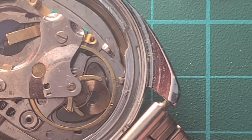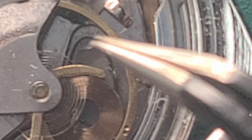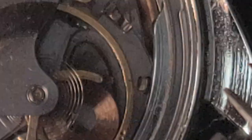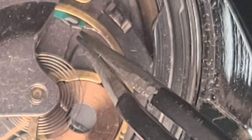And if you don't put the shunt bridge screw back in, then the rest of the movement will just come apart. And this is where lots of problems can happen, because if you just need to replace the balance and you weren't expecting to reinstall a bridge that had a bunch of pivots on it, well, this might suck, because it has pivots and it has additional contactors, which are a bit springy. So things can kind of get a little messy here. So try to avoid that and reinstall that shunt bridge screw, even without the bridge installed.